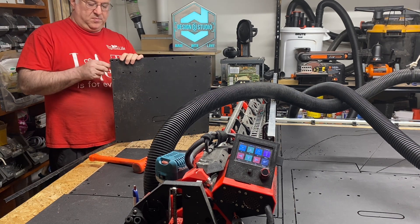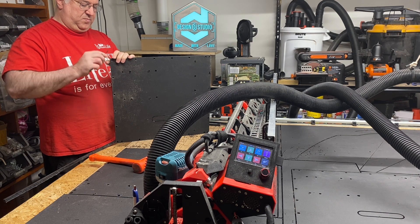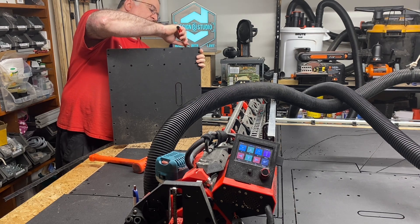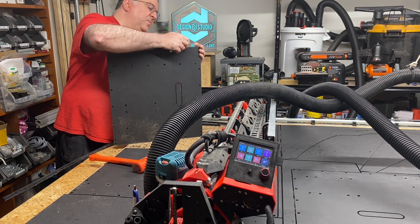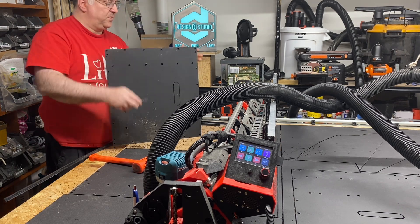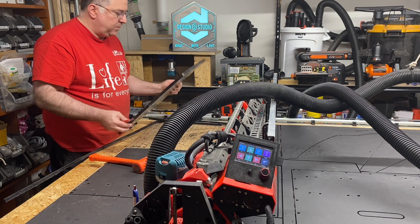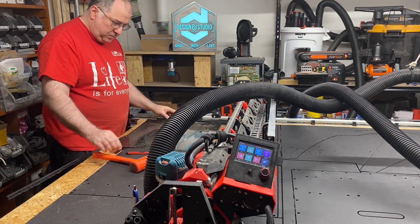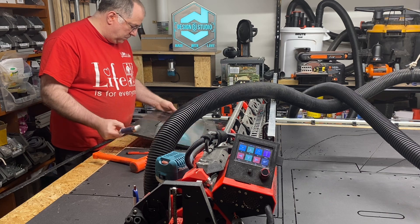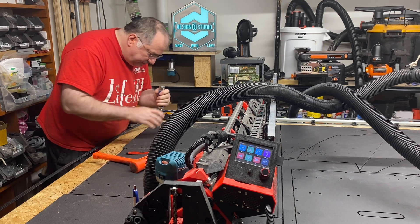The bottom line is that I got the enclosure panels cut and they're looking great. I'm still sourcing things for the bill of materials for the two mostly printed 3D printers. I wanted to get this video out and show you that it is totally possible — regardless of whether you're cutting with a quarter-inch or eighth-inch bit — to get phenomenal, crisp results when cutting HDPE. The trick is to have the right feed rate. Also, attack it with a nice sharp bit; if your end mill is dull, don't try to cut HDPE with it. End mills are so affordable now it doesn't make sense to waste time using a dull bit.